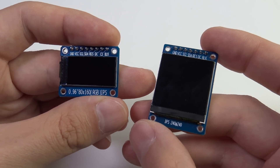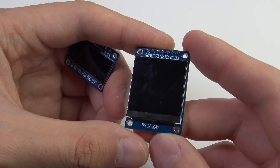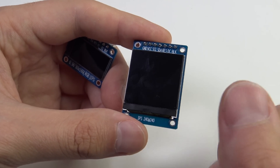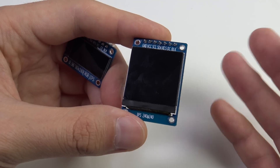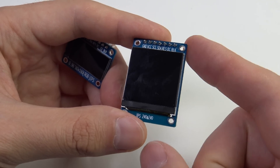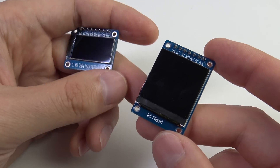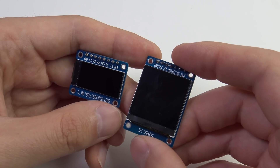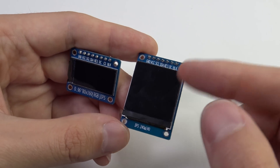All other work with the display is essentially the same. Working with the displays is straightforward: first, commands are sent to select the screen region to work with — horizontally and vertically — then a command is given to load color data, and the data itself is sent to fill the selected region. You can work with the whole display or with individual regions. Both display controllers have a frame buffer — RAM — which is what is actually shown on the display.